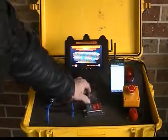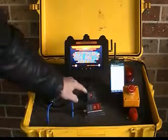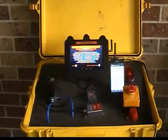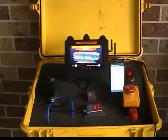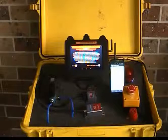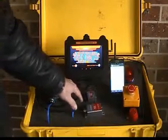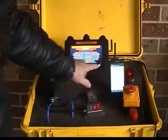This one would be for the trailer, this one for the main body, and this one here is used for measuring the tipper bed. If the operator is driving whilst in transit and the tipper bed is raised, it will set an alarm and SMS and email to tell the owners of the machine that the machine has raised the tipper bed in transit, and it'll give GPS position and time of the event and machine identification.